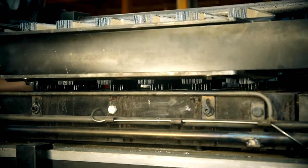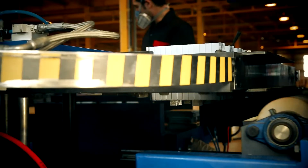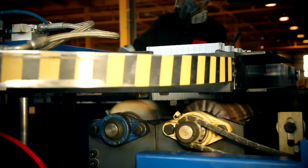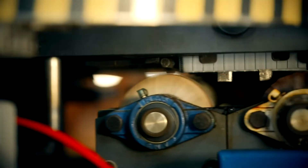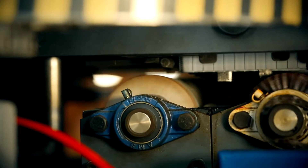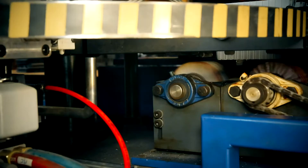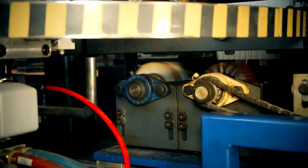For correct preparation of plate blocks for the welding procedure, brushing and fluxing procedures are integrated. The brushes used for eliminating the oxide layer formed on plate blocks have a special structure that does not decrease lead thickness and leaves no deep scratch that flux may stay inside.